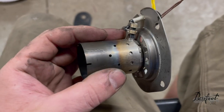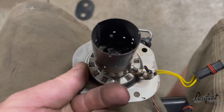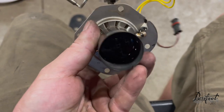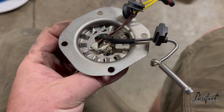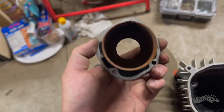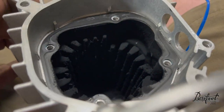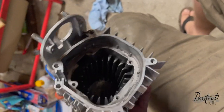I'm not gonna pull the glow plug out. I'll regret that later when it turns out it doesn't work and all I needed to do was pull the glow plug out because it's really dirty. But I don't really know how to do that — it's probably just this one screw and then it probably slides right out. I was wrong — you gotta pull this thing out and it turns out it's totally disgusting. And then once you've got that out and it's all nasty, look down in here — that's some carbon. More cleaning to do for sure. Well, that's all cleaned up. Looks pretty good.